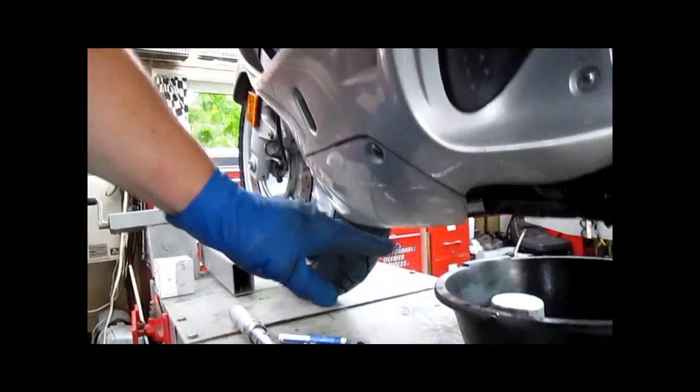You want to look at your oil sight window. You will not get an accurate reading right now, but make sure your oil sight window is not leaking and there is no oil crud mist built up around it. Those windows do blow out, and when they blow out they dump oil all over the exhaust, which will often catch on fire. So if you see it leaking, change it — there are plenty of videos on YouTube regarding that.